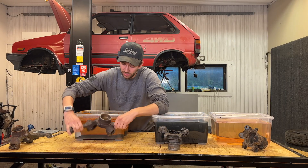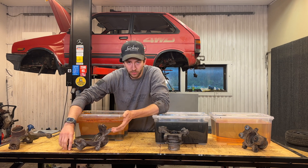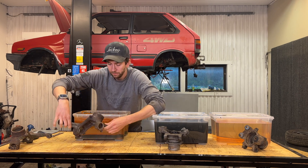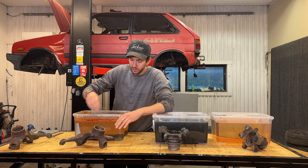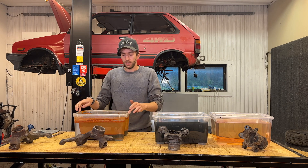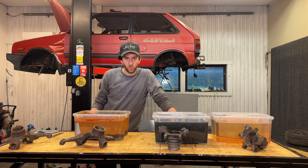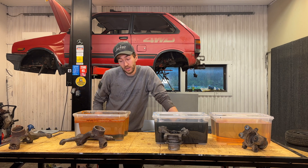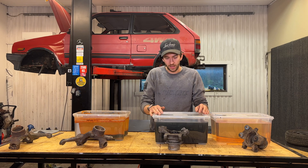The result with the electrolysis is also very good, I have to say. There's still some corrosion left, but this is very good, and I could have left it in for a bit longer and it probably would be even better. The steel itself is a bit darker, so something is up with that, but all in all pretty good. The electrolysis is the cheapest, but it's the most fuss - most work - and I don't want to leave it unattended, although it's most likely safe. So the Evapor-Rust is just good.